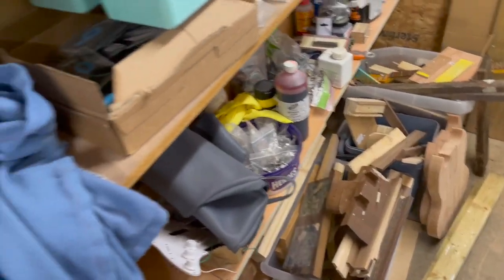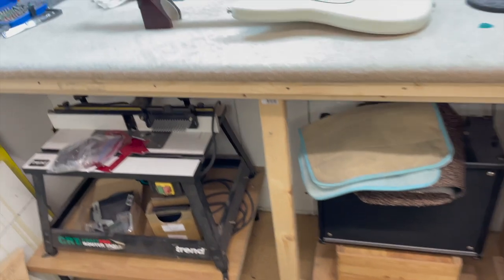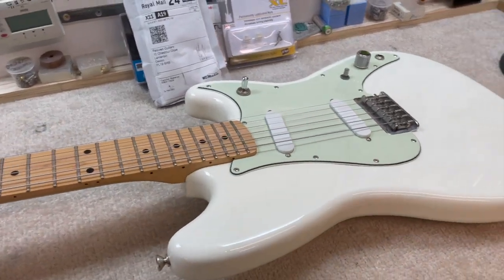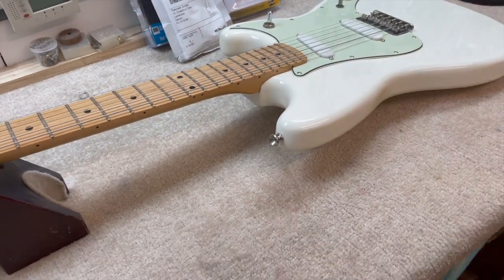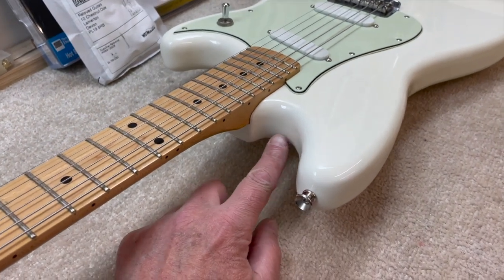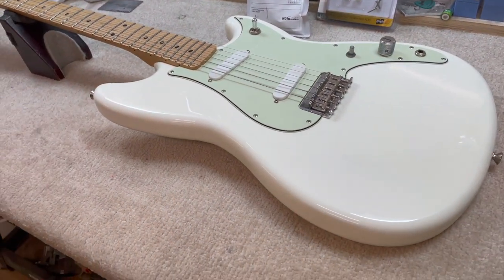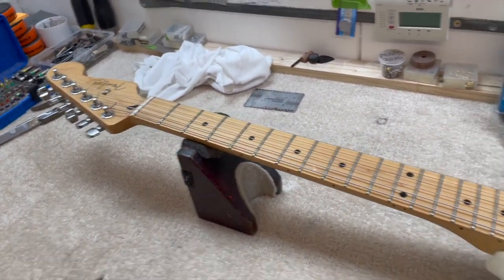It had a crack there in the finish that anybody and their uncle would have sworn blind was definitely only in the finish. And so I stripped it back and attached a sort of thing to the heel and bent it open a little bit in the vise. And guess what? I have got a dynamite picture of the exact same crack following the finish. It is absolutely in the wood. It's as clear as day, and yet the crack itself to begin with looked exactly like every single crack that everyone tells you is not in the wood, and it is damn well in the wood. And of course nobody ever strips off the finish to do that check. Well, I happened to do it, and so one out of one, the first time I did it to check like that, it proved that it was in fact in the wood after all.